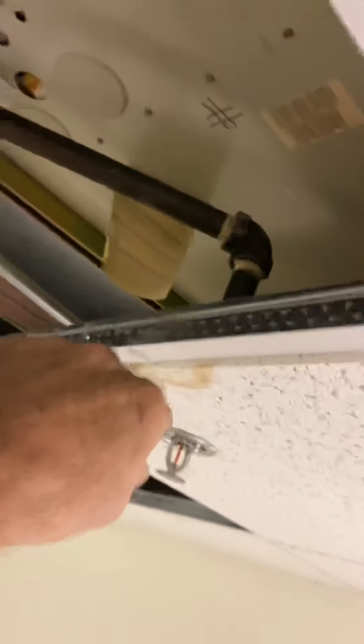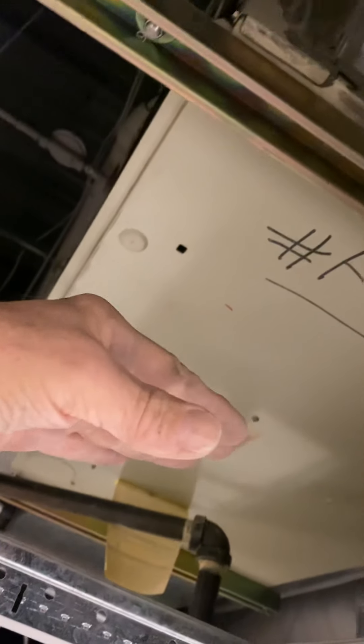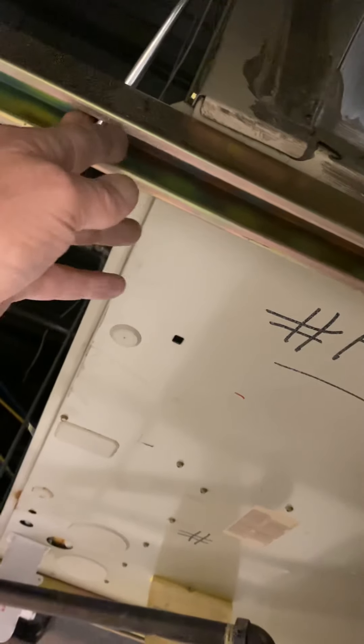We're just removing the furnace — we're going to leave this duct here and the coil. To get this out, you're probably going to have to take this sprinkler line tile out and turn the sprinkler line this way. Then unscrew the bottom of the furnace and maybe just cut the end of the furnace off with the high lift under it, and take down the unistrut angles.